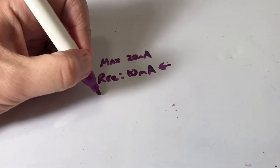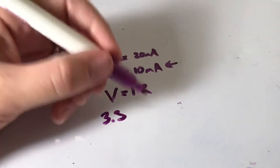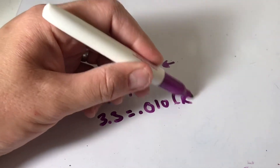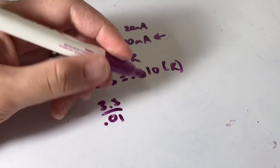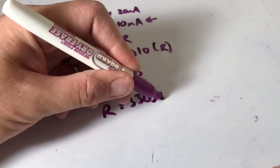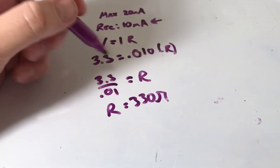To figure that out, we use the age-old electronics equation V = IR: voltage equals current times resistance. The Feather board is a 3.3 volt board and we want 10 milliamps. So 3.3 divided by 0.01 equals R — R is 330 ohms. That's the ideal to get 10 milliamps. They don't sell a 330 ohm resistor at Adafruit, and we don't want to go higher current, so we want to use a bigger resistor.